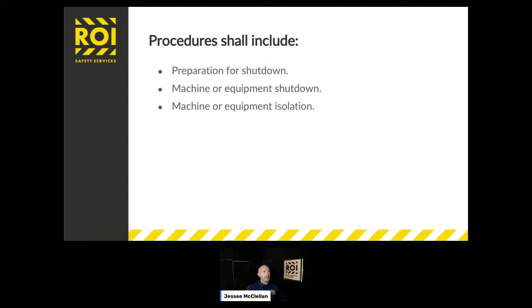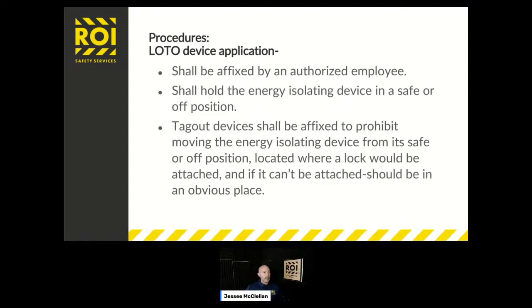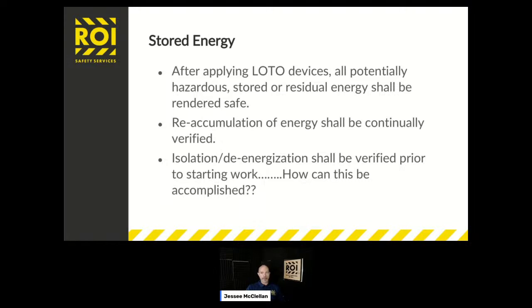Regular training, the procedures you need to cover. I would cover each one. These are just procedures how to shut down equipment, so they need to be site specific. So if you guys are using drill presses, mixing blades, punch presses, you name it, whatever you got going on, ovens, whatever you have at your location, make sure you lock and tag out and you go over those site specific procedures.